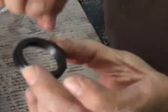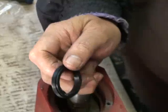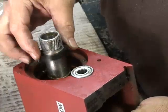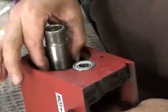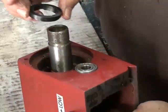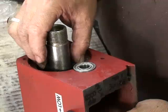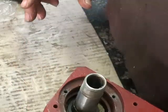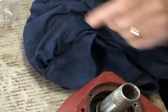I've now trimmed the edge of the spacer that goes on the other side of the spindle box — this one here. That edge has to go up against the bearing, so it will go in with the edge outwards. I don't believe the keyway on this spacer is important, because the keyway on the shaft doesn't reach this spacer. So that's that bit. Now we're ready to put the other bearing on.